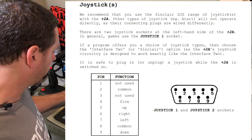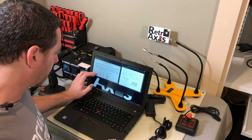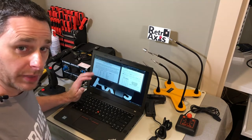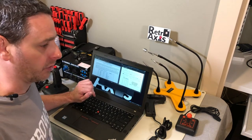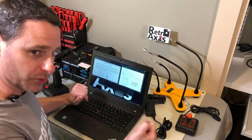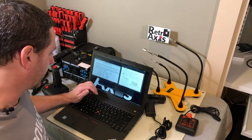The same is true for the other various pins. As an example, pin four is going to the right on an Atari, but on a Spectrum it's the fire button. I know this is true because when I plugged in the Atari joystick — the joystick I thought was a Sinclair joystick — every time I would move the joystick to the right, it would issue the fire command for whatever game I was testing. So I do know that is indeed the case.